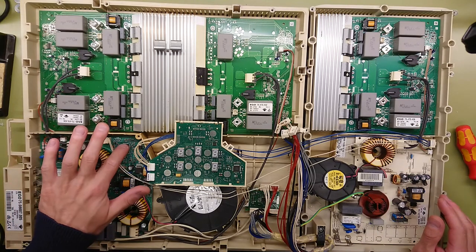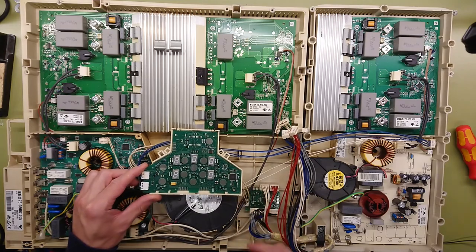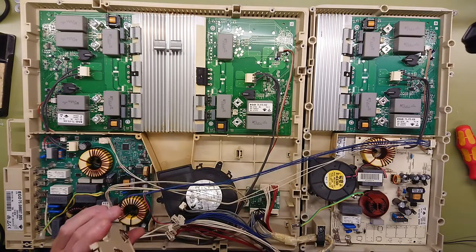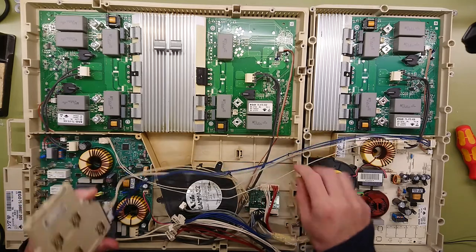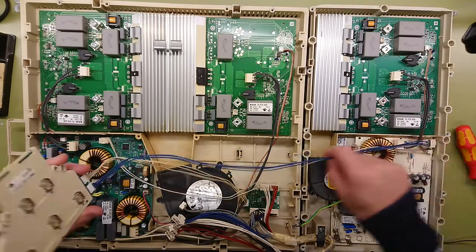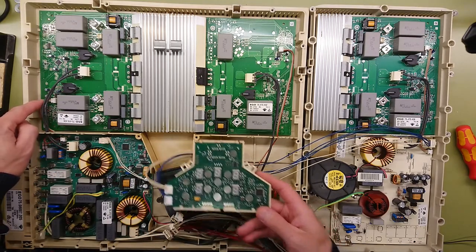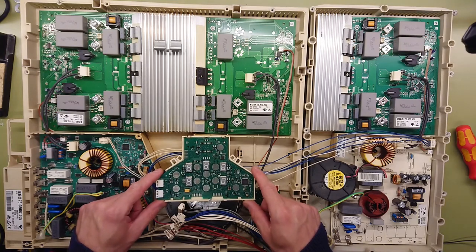The main board is controlled by an ATmega32 controller, and the same goes for the control panel — it also has an ATmega32. The encoders at the front have an ATmega8 controller, and they are all connected via two-wire communication going back and forth between all the boards. The bus communication is spread out with very long wires and a flat cable connecting the various bus connectors across the boards, which isn't an ideal layout for bus wiring.